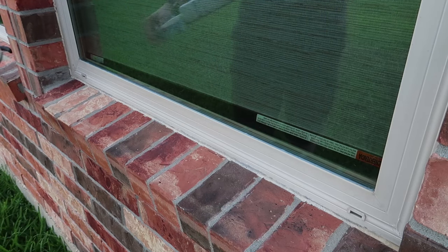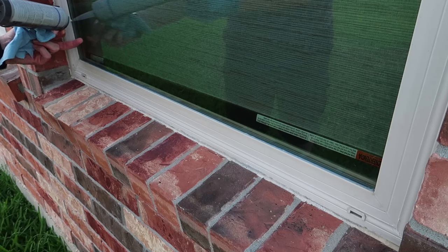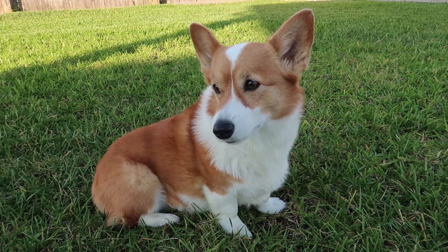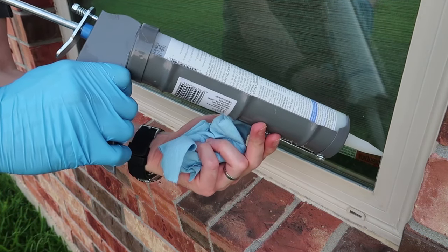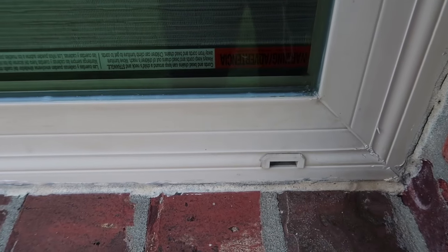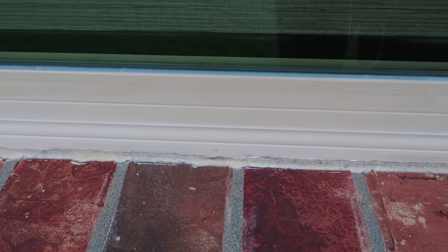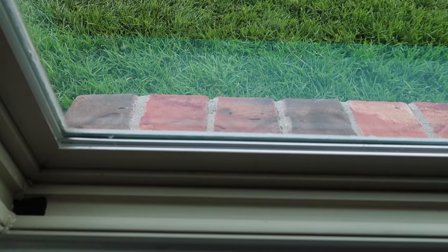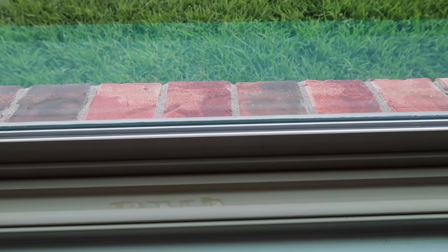You may be tempted to use your finger to spread the sealant the way you would with caulking, but I would recommend not doing that — if you smear it onto the window it's going to look really bad from the inside. Here I'm coming back and filling the corners in, and also going up a few inches to help prevent water from leaking down the sides and making its way back into the bottom of the frame. Here is the finished product: a small bead of sealant between the frame and the window. From the inside of the house you can barely see it if you look really close — this is exactly why you don't want to smear it with your finger.